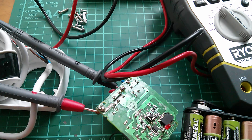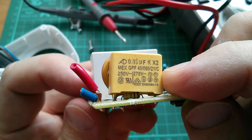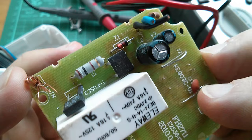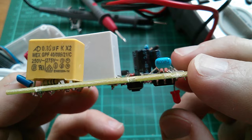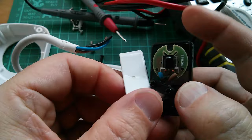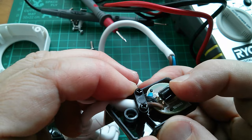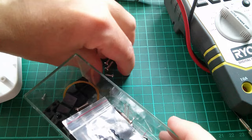So I really don't think there's anything worth salvaging here. There's an X2 capacitor with a one-meg resistor actually soldered directly underneath it, which is slightly odd. Some sort of MOV-type thing there. Something called a T-fuse. That bridge rectifier - that square one which looks fairly interesting. But in fact the most interesting thing for me is this little 8-meg ceramic resonator connected directly to the microcontroller. I'm not sure I can even be bothered to take that out. The little sensor is just literally a little infrared photo-detector - transistor presumably because it's got three legs with three wires running into the module. Yeah, it's just boring. But I'll keep these screws - always worth hanging on to various different sizes of screws.